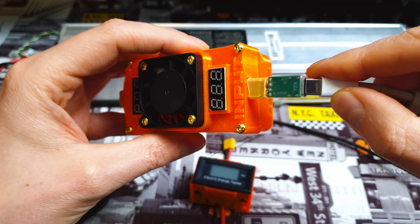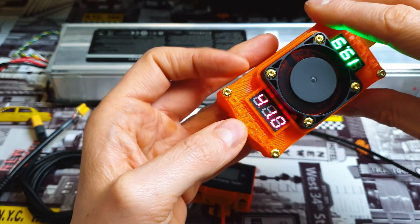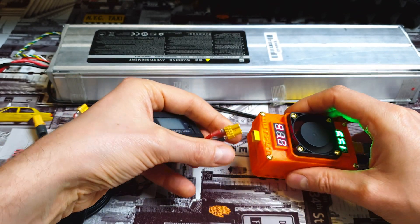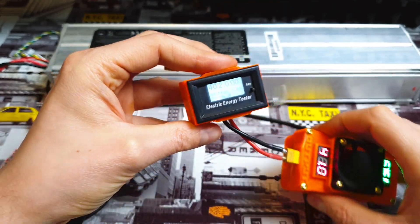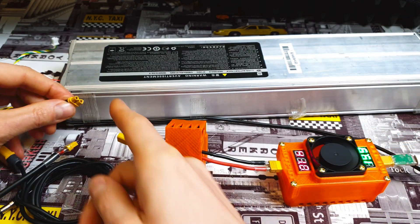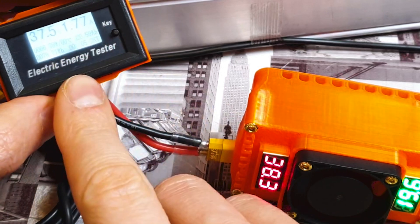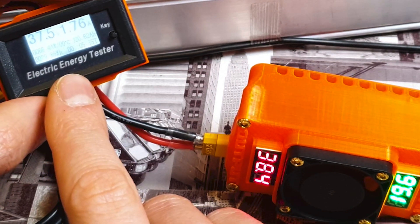Let's connect this to the home power socket — moment of truth, will it work? Let's connect the USB — and it's working! As you can see, on the input we've got 12V, and on the output I've got 41V. The best thing is that using the step-up converter, we can set what amperage and what voltage we'd like on the output. Now let's connect my power meter on the output so we can see the output voltage and power — we've got 40.2V. Here you can see a Xiaomi M365 Pro battery with XT30 output. Let's connect my charger — no magic smoke — and it's working, charging the battery at 1.76A, which is around 67W.